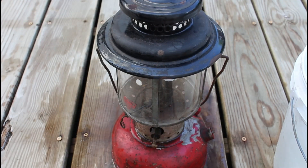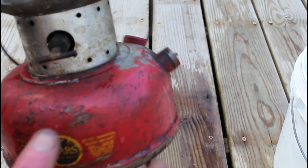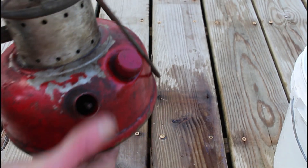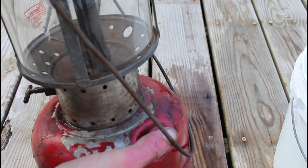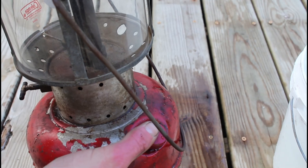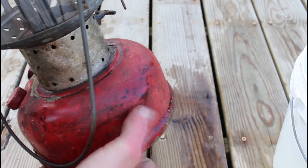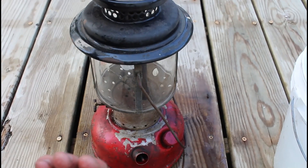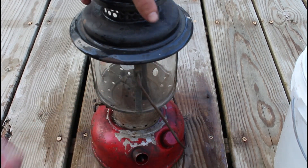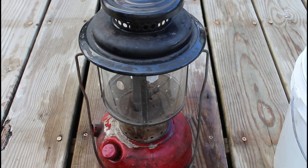That's how you figure out a leak. If you have a crack in your tank, you'll see it out of a weird place. If your check valve is bad, you'll see bubbles coming out of there. In this case, the gasket seal is bad, so we saw it leaking there. If the tank is shot — paint flaking off — that's a little bit harder to repair. This is pretty easy; we're going to cover it soon. Thanks for watching.